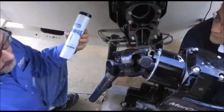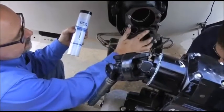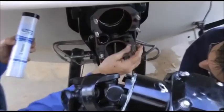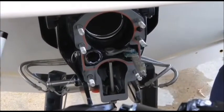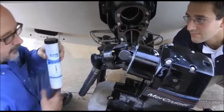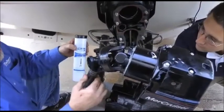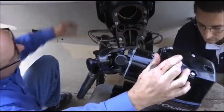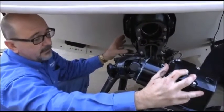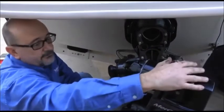Now that we're ready to reinstall the drive, we've installed new O-rings on the shaft and put in the Mallory Marine gasket and O-ring for the water jacket. We've used Mallory Marine grease to grease up the slide. Make sure your slide shift is in place and everything is lined up straight, and that the shift mechanism on the drive itself is in the forward position. We've also used our high-pressure drive shaft grease on the splines — make sure you liberally coat the splines and O-rings. We recommend doing this once a year. A lot of newer drive units have a greasable engine coupler accessible from inside the boat, but it's often impossible to reach, so inspecting the drive annually is a surefire way to keep it in good shape.